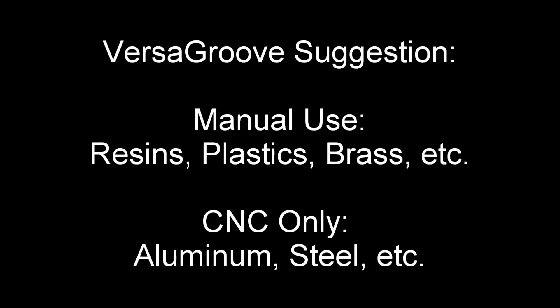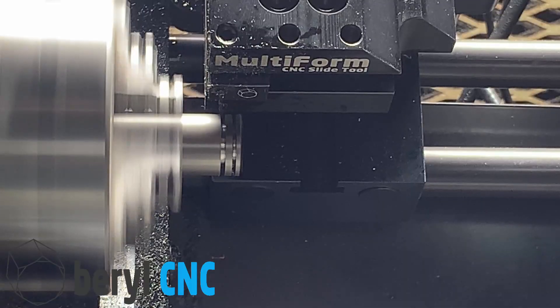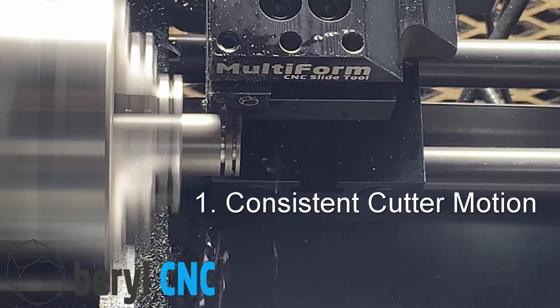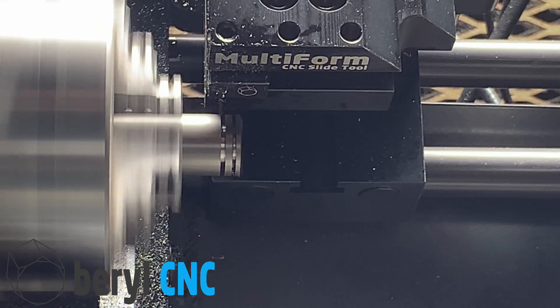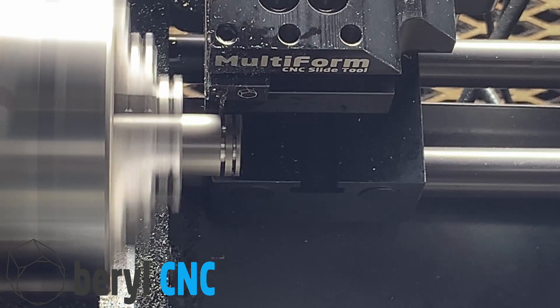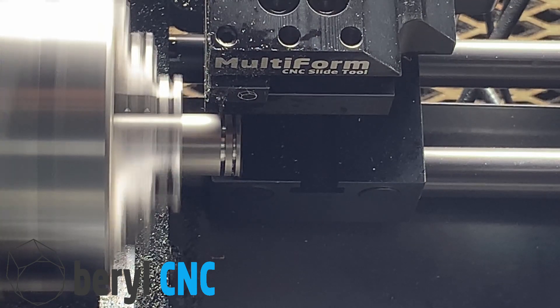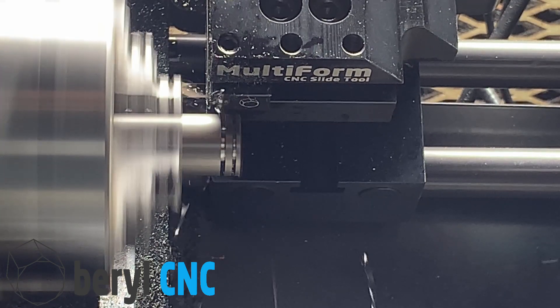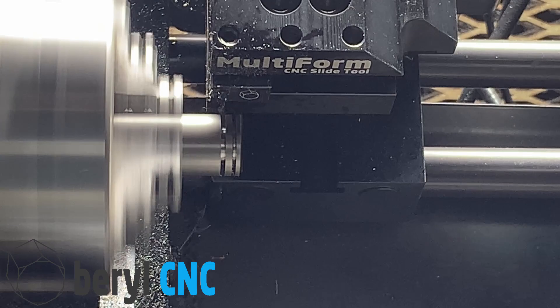Please don't try this under manual control on the mini lathe unless it's with a softer material. The CNC add-on gives us some critical benefits that tip the odds in our favor when working with difficult materials. First we get consistent cutter motion via the CNC control. Then there's chip clearing by quick retraction moves. Then we want to avoid pinching and chip binding by moving a little bit in the Z-axis, providing clearance so chips can sneak out through the crack between the cutter and the material. And finally, this is all achieved through small monotonous pecks that would be absolutely impossible to repeat by hand — that's what you get with the G-code and the CNC setup.